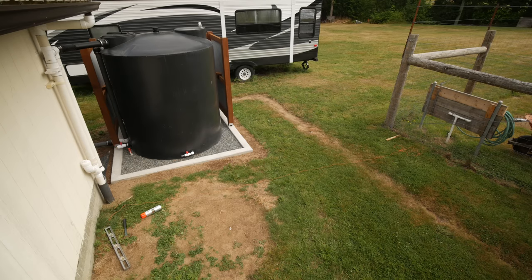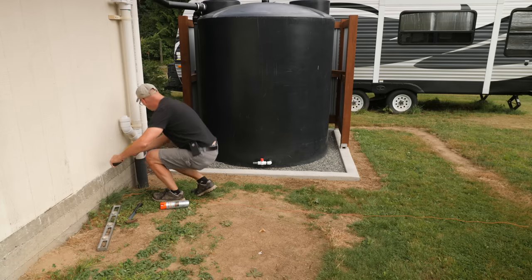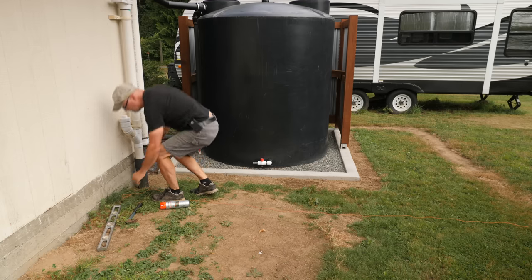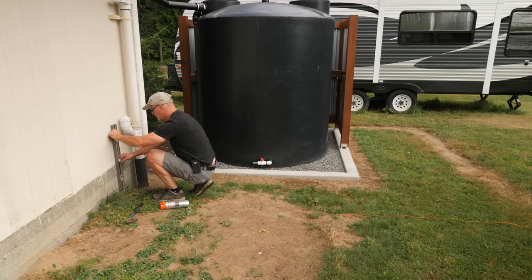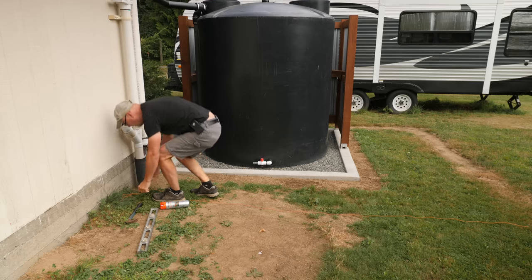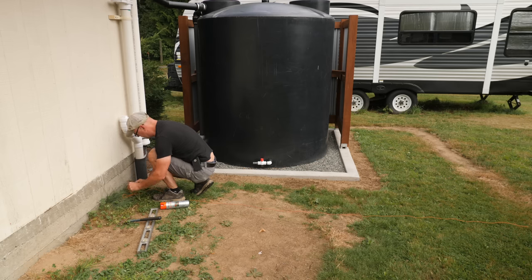Our shallow irrigation well is over in the corner of the property — it has a water line running under the field toward the house and past to the shed. A few years ago when we put in the garden I tied into this line and installed several hose bibs. I have a pump to pull water from the rainwater tank and send it to the garden. The plan is to turn off the well pump and close its ball valve, then turn on the tank pump so it can take over watering when the drip irrigation timers come on. The pump will be set up in the shed and I'll run a one-inch water line underground and tie into the garden system.